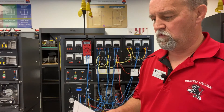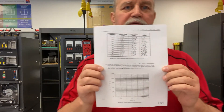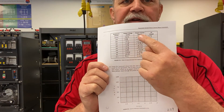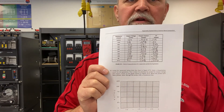So I've got all the readings for the chart on page 229, and that should allow you to fill out the graph. I'll post this page in the video. You're going to take the output voltage and output current from our DC generator at these different settings and plot them on this graph. It's going to show you the characteristics of this generator.